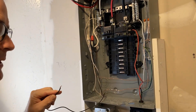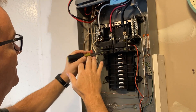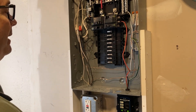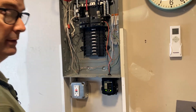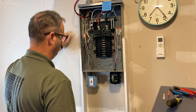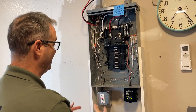What we've done is installed a remote GFCI and/or arc fault to protect an existing older circuit to meet code. This is a big deal because when you're remodeling - like in the story I told - it was an eye-opener. You can get an arc fault combination GFCI receptacle and cover all those bases. Let's turn it on - stepping to the side - test. Good. That dishwasher that was directly wired to the breaker is now wired line and load through the GFCI, creating readily accessible GFCI protection.